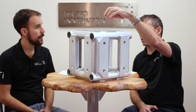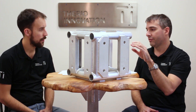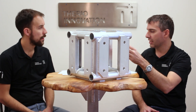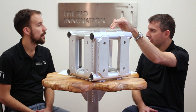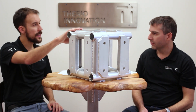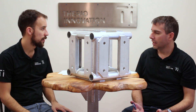And if you want to rig it directly in the cube, you may have to stiffen the cube for that application. Sometimes you can have a lifting lug inside the cube, but that would be a custom cube. And if you rig inside the cube, the same rule applies — you reduce your capacity by 50%.